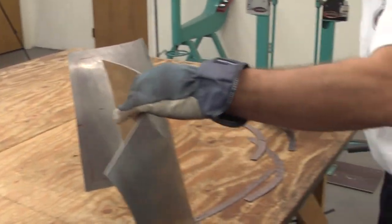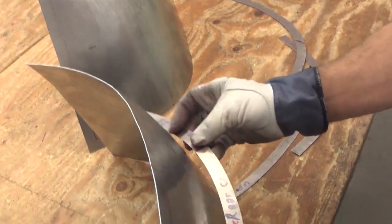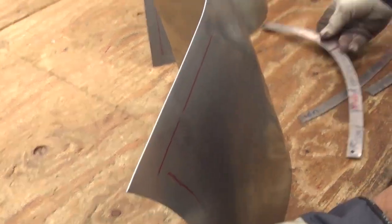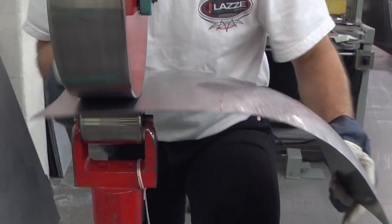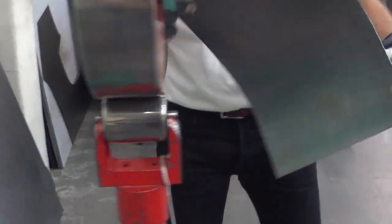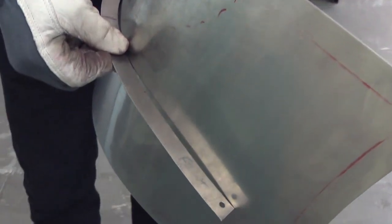I can check the other one as well and see where we are. This one should be in the middle — if I bend it just a little bit, I think it's pretty close, same as the other one. It's a little flat there, but we can easily bring that up. I'm looking at the surface all the time when I'm wheeling now. That brought it up a little more and I need to go at least a little more.